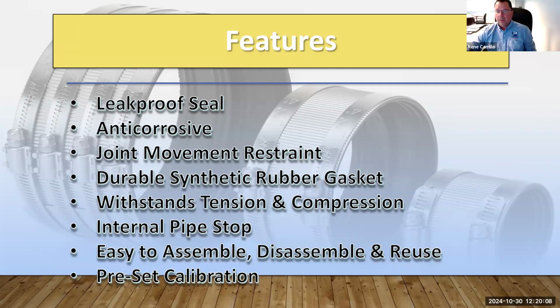There might be. When it comes to the water and the testing, there's really not so much a difference. But when you go cast iron to cast iron, you're really putting either a fitting to a pipe. There are some reducers, which you can do, like a 4x2, a 4x3, 2x1.5. But normally for cast iron to cast iron, it's recommended to just use the standard no-hub. The specialty line is called that because it's more for dissimilar types of pipes. The gasket is different, the way it's formed. It's really for those oddball types of connectors. But we recommend just staying with the standard no-hub if you're doing cast iron to cast iron.